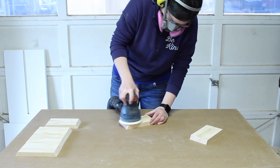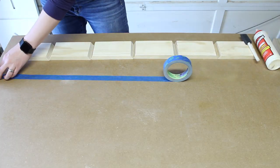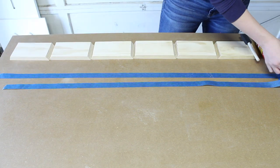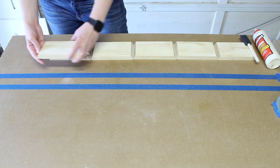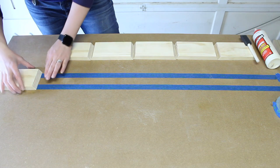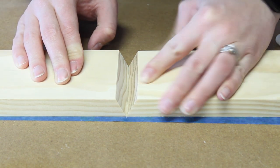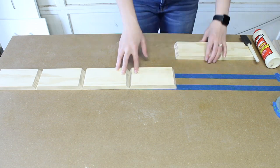I'm going to sand the inside — which was the short side of these boards — because I won't be able to sand it once I glue everything together. So I'll pre-sand that, and then lay out some masking tape. I just have one-inch masking tape on hand, so I'm going to lay two strips with the sticky side up. If you've got wider masking tape you could just do one strip. I'm going to tape this down to the table, put my wood pieces directly on top of the tape, and the tape is going to act as my clamp when I go to glue. I'll press each piece down for good adhesion, butting them up right against each other with sides aligned and no gaps between the pieces of wood.